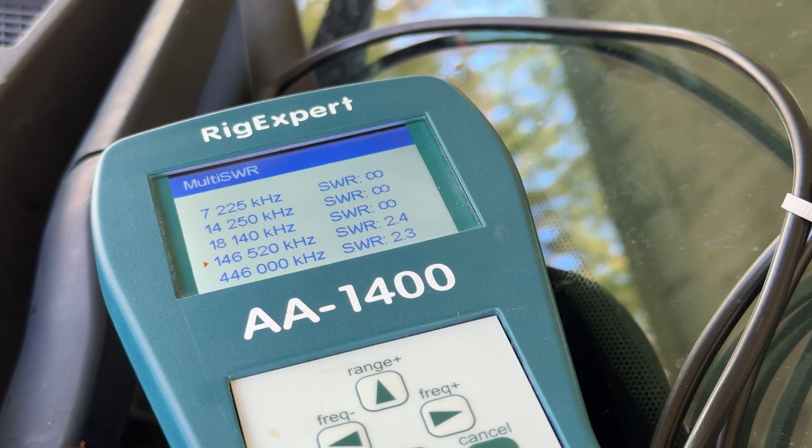We've got 2.4 and 2.2. Let's see if I can drop this a little more and maybe tweak that in. Going about an eighth of an inch at a time — the readings are hovering around 2.3–2.4 on VHF and 2.3–2.5 on UHF. VHF is going down slightly while UHF is going up a little bit. We're not seeing much difference either way. I'm about back to where we started, and I can see the mark on the antenna — I think we've found our sweet spot. All the way down gives us 2.0 and 2.8.